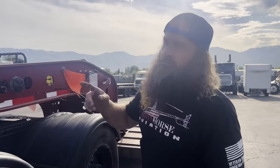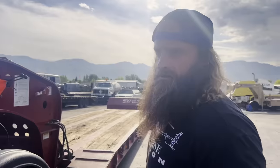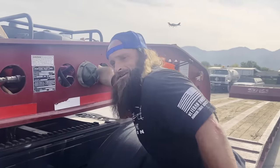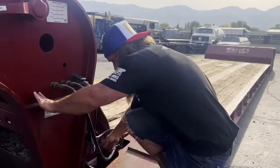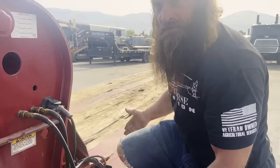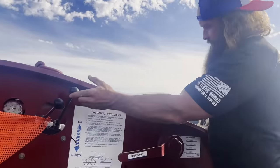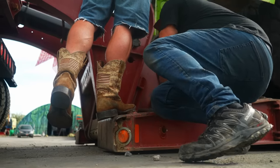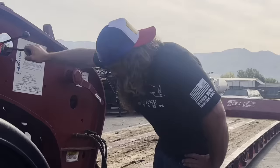Now it's time to load up the ninja turtle truck. We're going to go to Idaho and pick up a tractor out of muddy fields. Step one is we got to load it on this trailer — the glory of the low boy. We'll start with dropping the trailer first. You gotta turn it off, then you come over here, you pull the lock pin out. Now you got your right height locked in, so you go up just a little bit with your low boy and then drop her all the way down to the ground — that's why we call her the low boy.